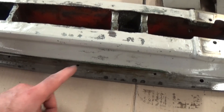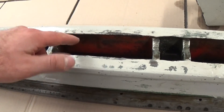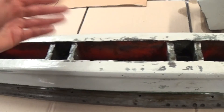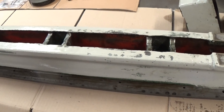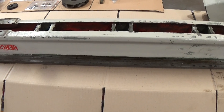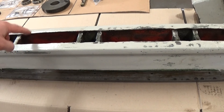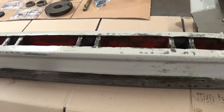I'm going to mask off all the ways. I'm thinking I'll brush-paint the red inside first - that's not a critical finish, just covering the casting, so if it goes over the sides a bit I can clean it up and repaint it. Then I'll mask all that off and spray the final colour. For order of operations: strip the paint off the outside first because that'll send paint chips flying everywhere and I don't want them inside once I've put a coat on. So: strip paint, then mask up, then paint the final colour.